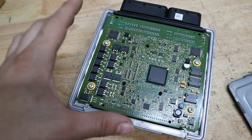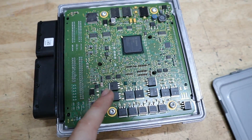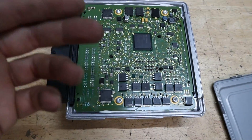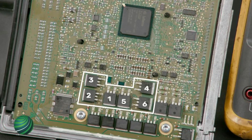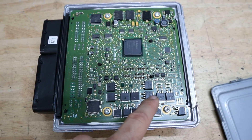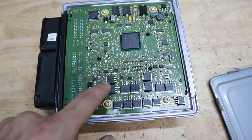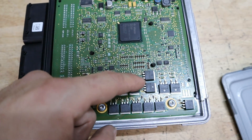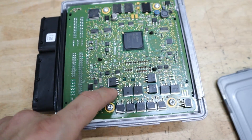We have the DME uncovered. These are the six MOSFETs that control the injectors and coils — they're rated for a specific amount of voltage, and the new ones are rated even higher. This one seems a little discolored compared to the rest. The MOSFET order is one through six. Since this one is discolored and we have a bank two problem, these three are connected — when one fails you get the entire bank misfiring. There should be continuity between the middle pin and the backing plate, and a certain resistance through the outer poles. If there's continuity with no resistance, it's failed.